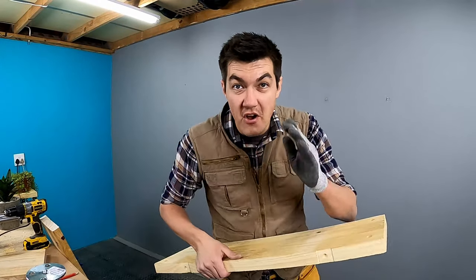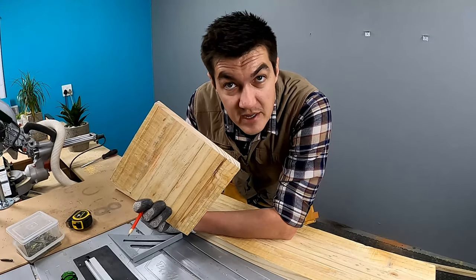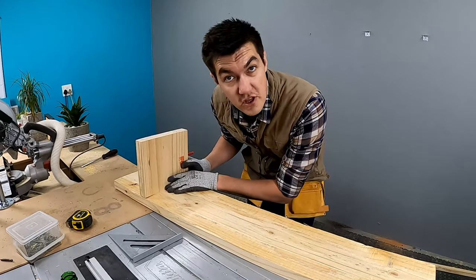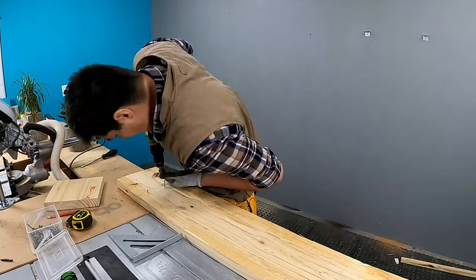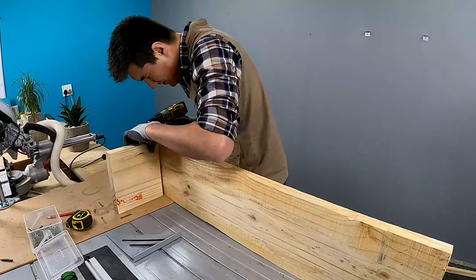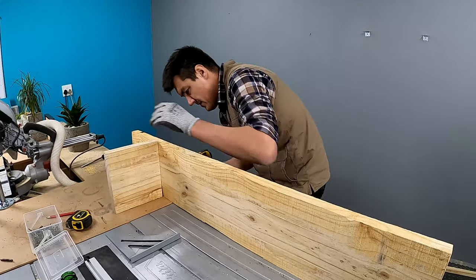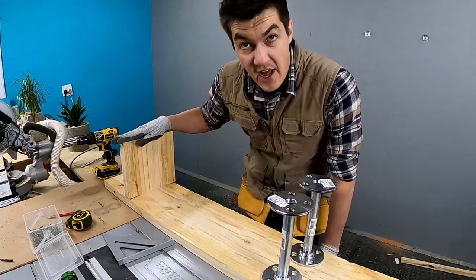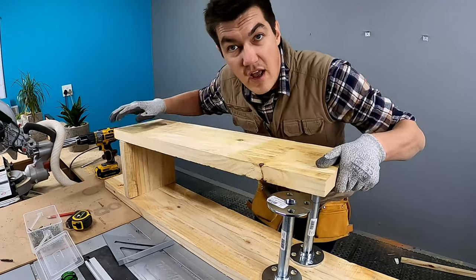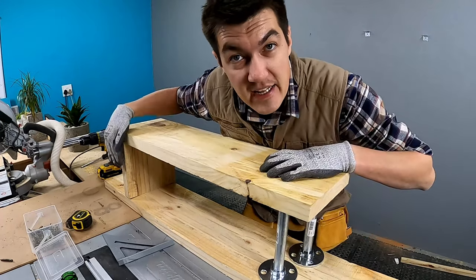Just as the first floating shelf, we're going to fasten the final floating shelf the same way. We're starting off with a small piece of wood - 210mm - this is your bottom piece of your floating shelf. 200mm from the side, we're going to fasten the smaller piece to the bigger piece. Now that my smaller piece has been fastened, we need to mark exactly where the pipe fitting is going to be. I want the top piece of pine to have a small overhang on one of the sides. Now we can fasten our top piece of pine to our pipe fittings and to our shorter piece of pine.